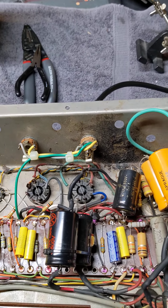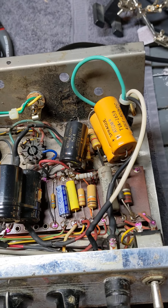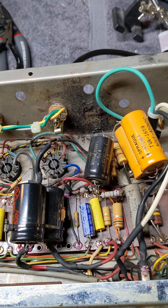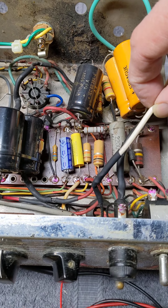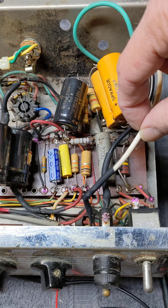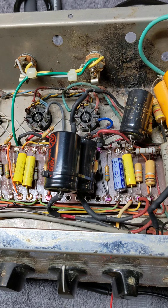There's also that loose can capacitor back there, which I don't want to touch because the amp is on, but all this stuff has got to go — it's got to get mounted without this crazy shrink tube and stuff. This is the wire that feeds the main part of the transformer, the primary winding, and it's supposed to be connected to one of the lugs on the standby switch, not hanging out in free air like that.